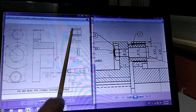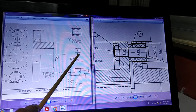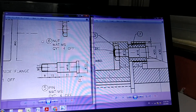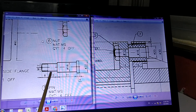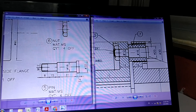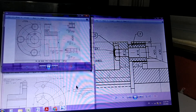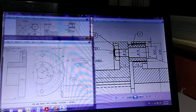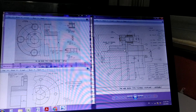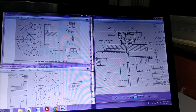The pin is shown with multiple diameters: a 3D section, plain diameter of 16mm, 20mm diameter at the head, and all details are given. One set of detailed part drawings is given on one page and another set on another page. After studying all the detailed drawings, you have to think over and draw the final assembly drawing, which is the coupling assembly we have been discussing throughout.